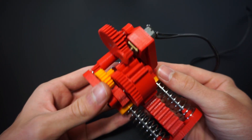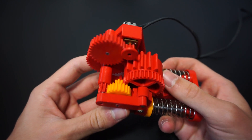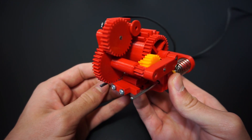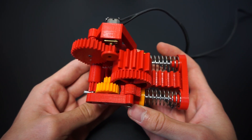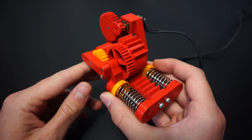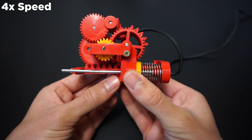So first let's take a quick look at this old prototype. Here at the top we have a small DC motor with a tiny gearbox. Of course this motor couldn't compress those two springs by itself, so I designed a second 3D-printed gearbox that greatly increases the output torque and is also painfully slow. All of that torque goes right into this big pinion gear, which as you can see has only five teeth on each side. So when it slowly rotates, the rack goes along with it, which causes the springs to compress.